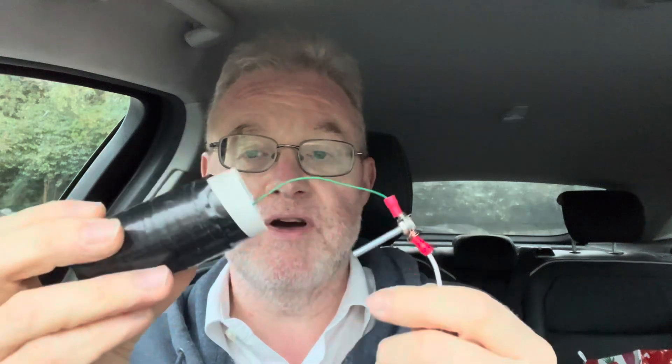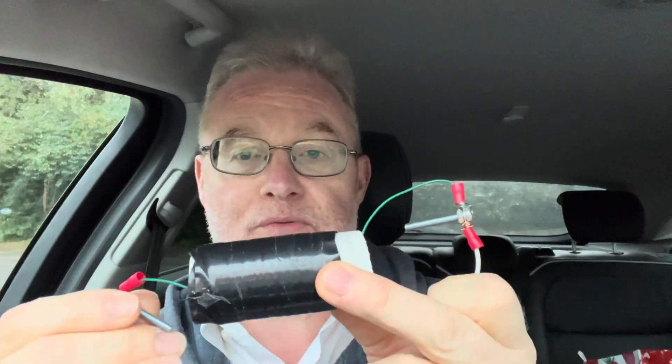The antenna itself is basically made up of two wires. The first, as depicted in this rather tangled mess of wire here, is the actual antenna. This white wire is literally just over a quarter wavelength long on 20 meters. We then have a rather rough and ready 33 microhenry coil, and you can see that the coil sits at the top of the quarter wave. In this green wire is about 1.3 meters of wire just above the coil.